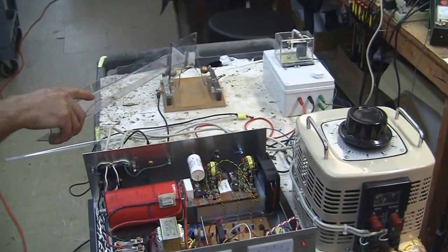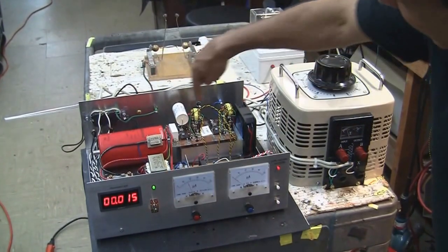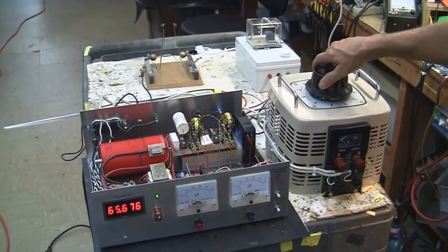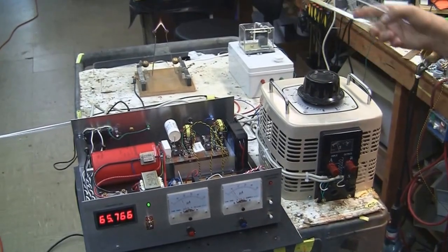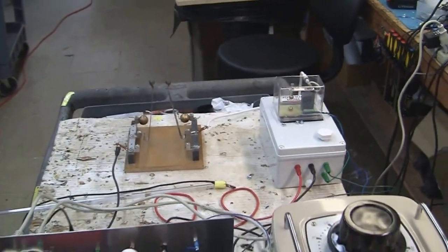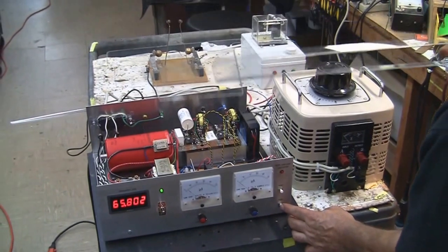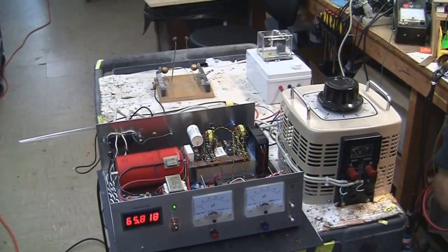You can see the safety gap went off. The shutdown came on. You still have voltage on the output amplifier, so turn your variac down and drain that power off, then hit reset and you can start again. Beautiful — you can demonstrate that one more time. You can focus on the safety gap and see that thing fire off. It's very fast. When you drain it you'll still have output power because you're bleeding off the power of the final amplifier. We could put a bleeder resistor on there but it would suck up a lot of power and generate a lot of heat.